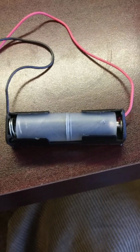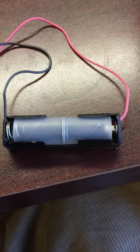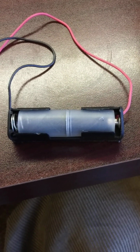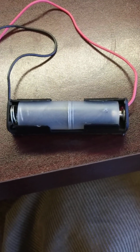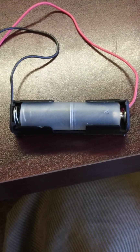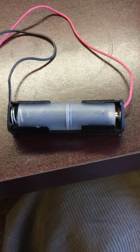I want to see in a week if the surface area changes, and that could be an indication that resistance is increasing. So there's a trade-off between the conductivity of your graphitic material and the resistance due to the surface area. You want both in a supercap electrode, conductivity and surface area.